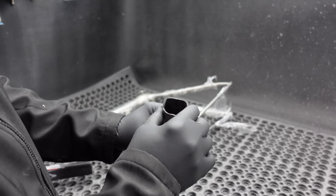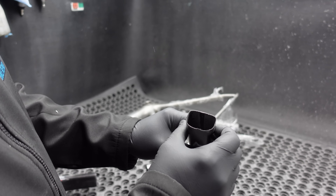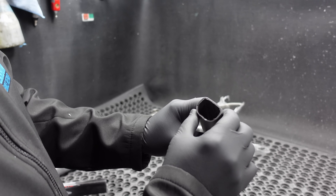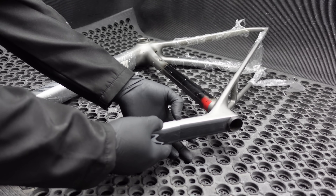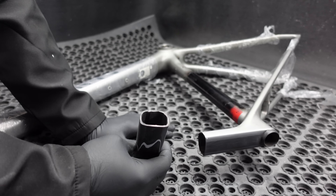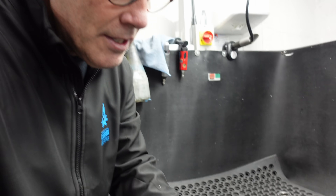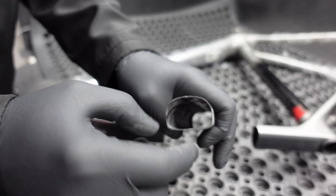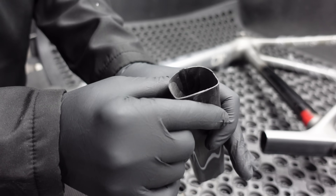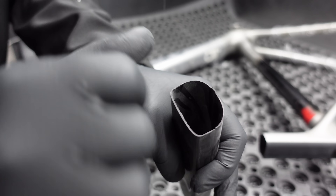This is on the manufacturer side, not the repair side. Same wall thickness, all the way round. You can see how it's tapered — they need more structural strength in this area. The level of detail in terms of its work is just brilliant, the way they've considered weight loss in this area and also flexibility in the frame. And you can see this is the original carbon down here, so it's not as if we've got thinner in our repair of the wall thickness.